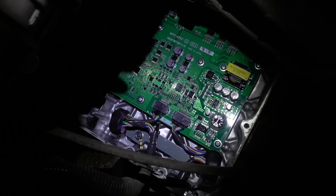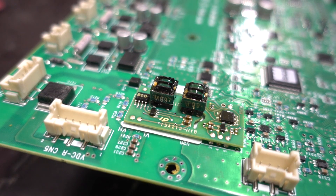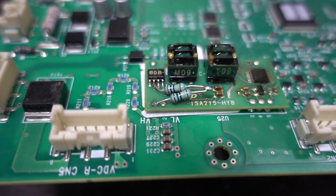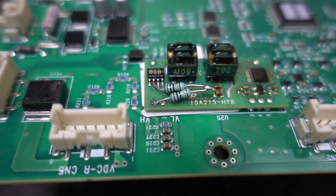Now I'm going to try to extract the PCB. This is the voltage measurement board section. To fix this glitchy voltage measurement, we're going to do a band-aid fix and solder in a 2 megaohm resistor. The repair is done — I've soldered in two 1 megaohm resistors, for a total of 2 megaohms, onto these pins. I had to scrape off the protective coating before the solder could bite. Let's see if this works — let's put it back in the car.